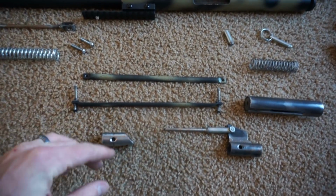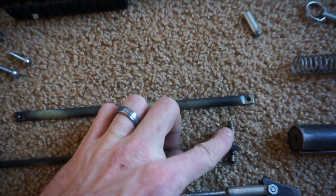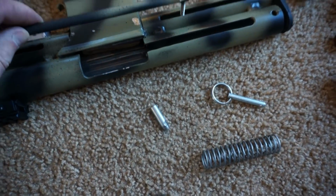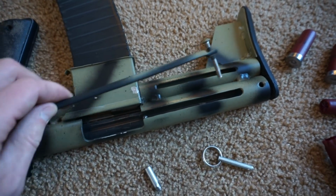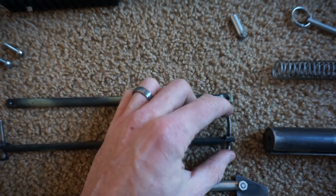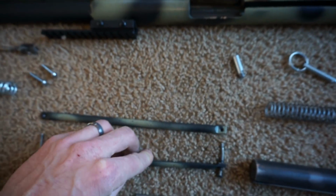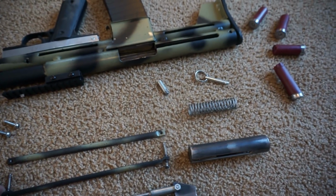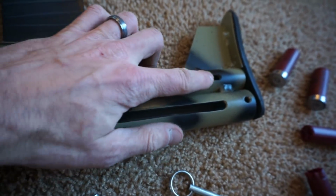So right here you can see, hopefully, those little bolts right here are bent, okay? And basically what that means is when this was cycling like this, those bolts were slamming into the back of there. These are not hardened bolts at all, and you can tell with the diameter, they're really small. So I think I'll replace them with like a grade 8 hardened bolt, because there's not hardly any wear on the back of that slot, and it would have had to have been hitting that.